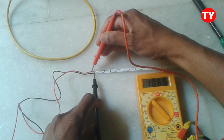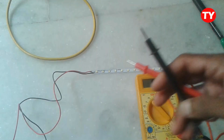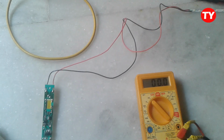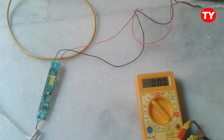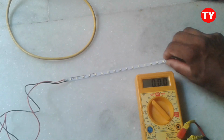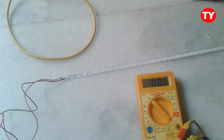Here it is showing 105 volt. So this SMPS is working very fine. In this strip, one or two LEDs may be defective, so we have to find which LED is defective. In the next video I will show how to replace this LED.